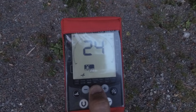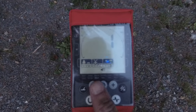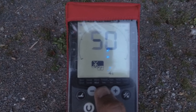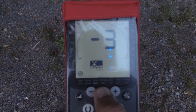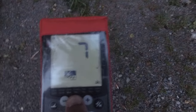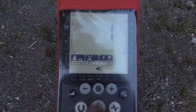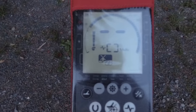Now, threshold — I set mine to 1. If we go across here, it's on the first menu. This machine has sub-menus, which we will cover on a different video. Just go into the threshold. You can see my threshold is set on 1. If you want to alter it, just press up or down. I find 1 works best to get the deep targets nice and clear. When you're ready to go, press detect.